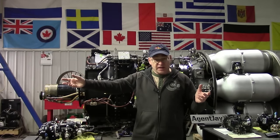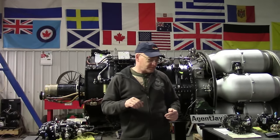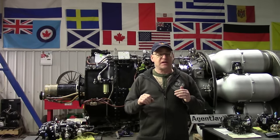What is a transfer pump? A transfer pump moves fuel from one tank to another. In larger airliners they don't have tanks in the wings — they have wetted areas that are sealed and full of fuel. For balance or consumption reasons you need pumps that will move fuel from here to there. I never deal with those; they don't need to be tremendously accurately metered, so they're most likely a centrifugal, non-positive displacement pump.